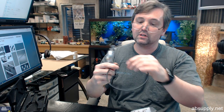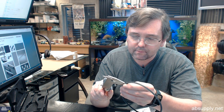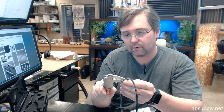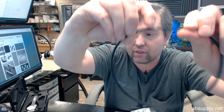Center to center on this is going to prove a challenge, naturally. Maybe not. The width of the groove, the width of the tooth, so to speak, on the belt, is 0.060. With the caliper, and this is tough, the distance between the teeth looks like it's about 0.046 inch. Obviously, I'm not able to be very accurate with that, but those approximations are going to prove to be 0.046 between the teeth. It's the best I can do with this caliper, and obviously this is a flexible-based item.